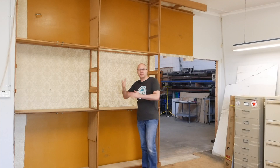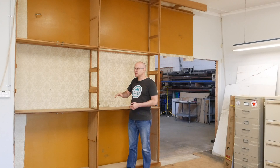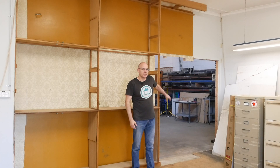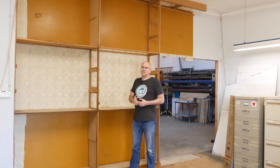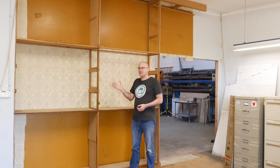And this wall is what we're going to demolish — we're going to rebuild this. The original plan was to save most of the structure of the wall, put in two doors into this gap here: one door going into the clean room, one going into the packing area and stock storage. But as we were looking at it we realized that there really wasn't much of the structure that needed to be saved. So the decision is that we're going to demolish this wall. It's not structural, it's just a partition wall, and then use cool room panels like the rest of the clean room to make a new wall along here.